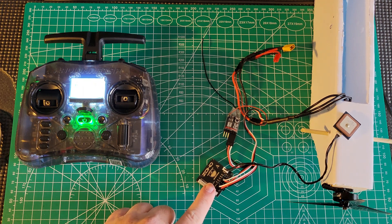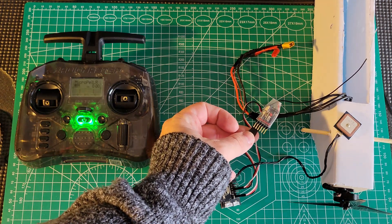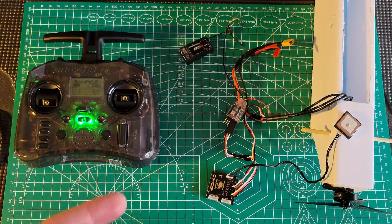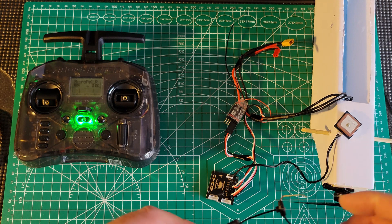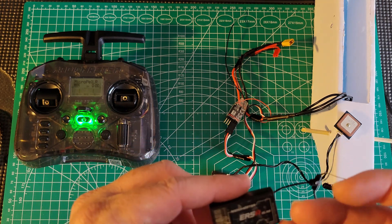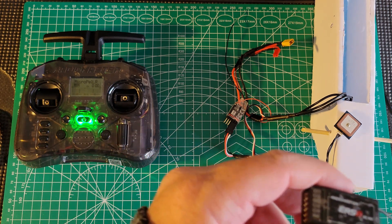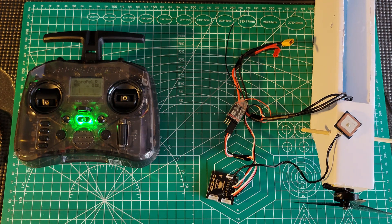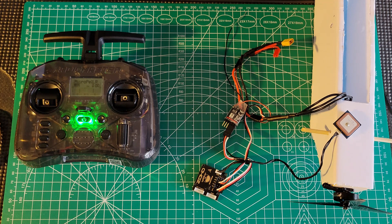We've got the ER4 in this case set up for SBUS. For those who aren't familiar or have dealt with this but aren't quite sure why — ELRS was set up and intended for quads, which is awesome. They have it set up so that channel 5 is a two-position function only, and the idea was to add some safety around accidental disarmings because of packet loss. Things like the Zod co-pilot and other gyros actually use channel 5 for mode switching.